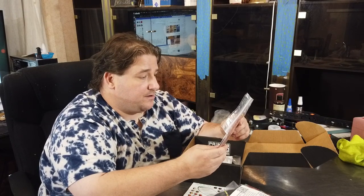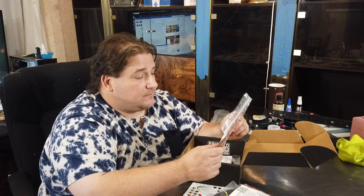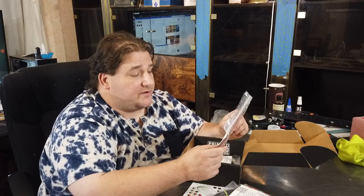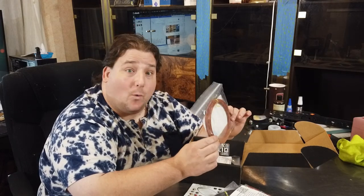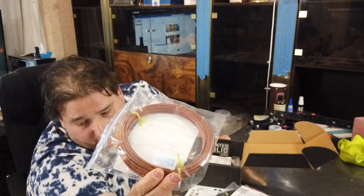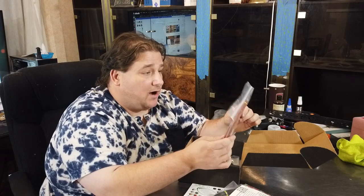This is called Heritage Brick from TREED — T-R-E-E-D. 220–240°C, so it's a higher temperature plastic. It doesn't say what it is. Made in Italy. From TREED's Architectural Materials line for prints with a brick light finish. Bed temperature 85 to 115°C, nozzle temperature 220 to 240°C. I am genuinely curious as to what this is because it really does look like brick. It feels like it has that stone-like roughness when you rub two pieces together. This reminds me of the FormFutura terracotta style filaments. Very cool. I actually look forward to trying that.